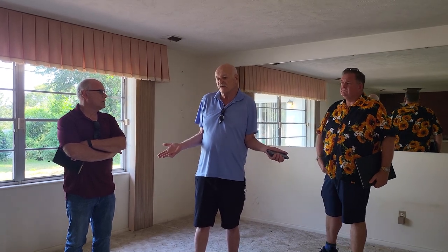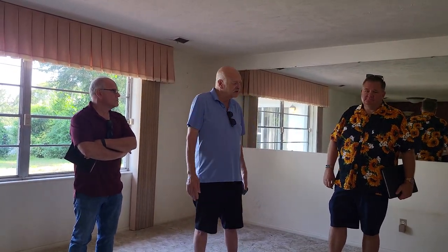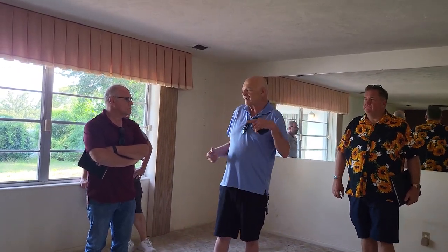That could cost you $10,000 minimum — maybe more in a 1,600 square foot house — just to rewire it. Because remember, they can't go underneath this house; there's no crawl space. In a house with a crawl space you can go underneath easily, pop up from the basement. Here you've got to bring the wires into the attic, rewire them, come down, open up drywall all over the place. It's a nightmare. And that $10,000 does not include the drywall repairs.